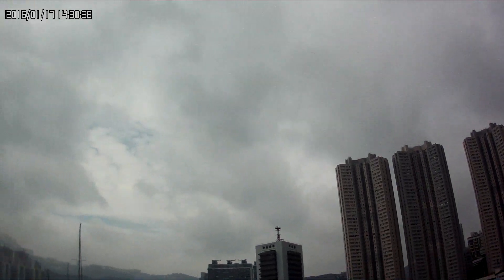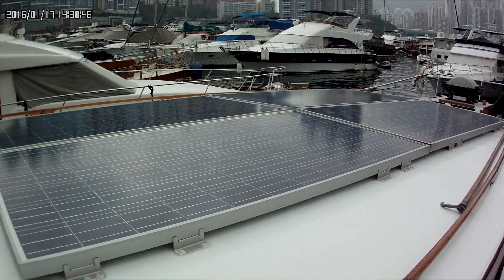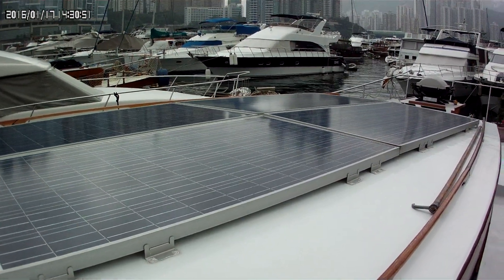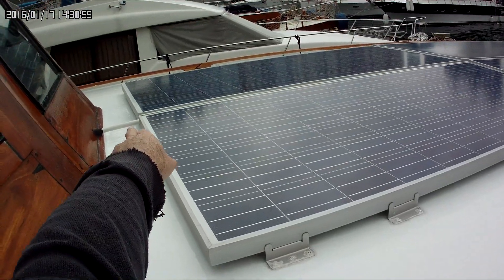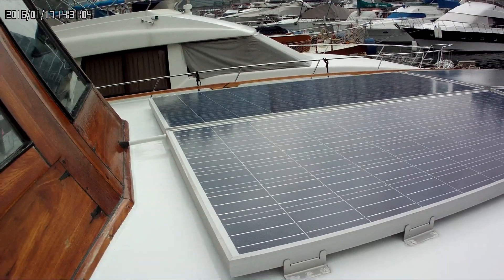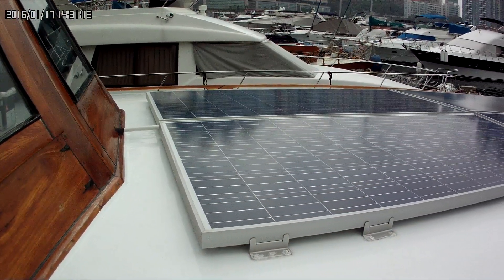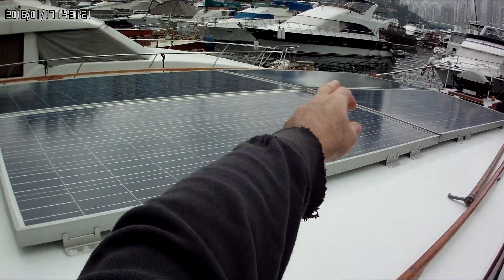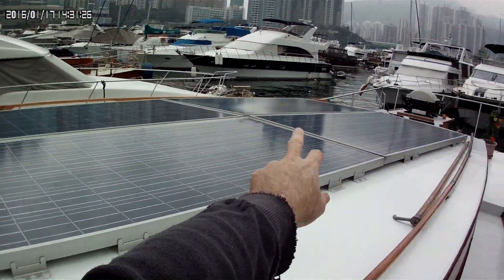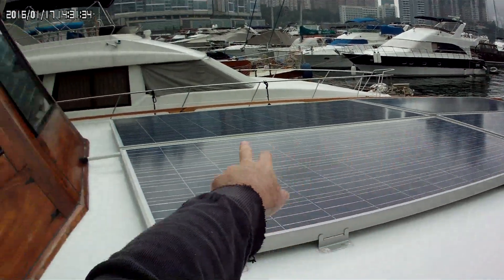Today's a pretty crappy day, not a lot of sunshine. Basically what I've got is four 300-watt panels. That's 300 watts at an open circuit voltage of 36 volts. They're all wired in parallel, so each panel has a positive and negative that comes through. There's a total of eight wires, and those are 6mm square — I think that's like 10 AWG — about three meters, roughly 12 feet. From that center point, all wires come together at equal length. So these four panels, which is 1,200 watts at 36-volt open circuit for a 24-volt system, come in to a control center.